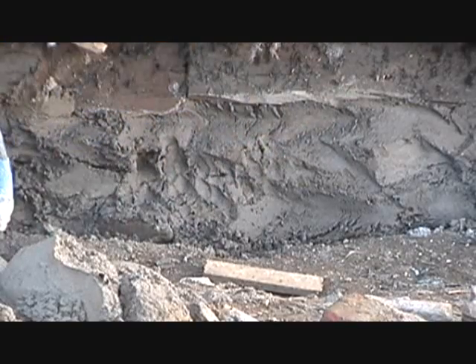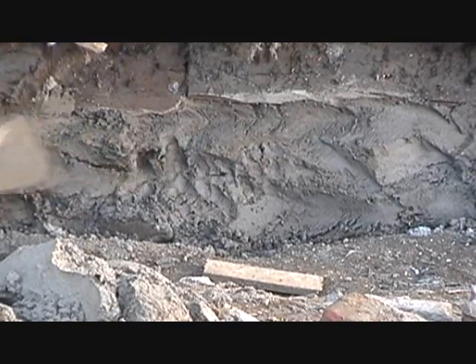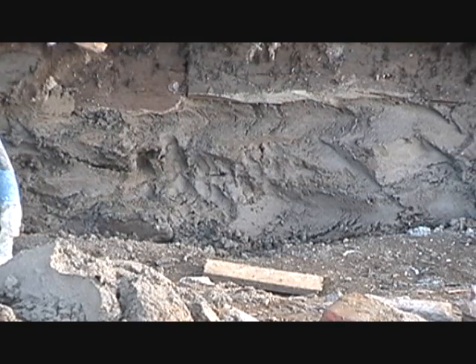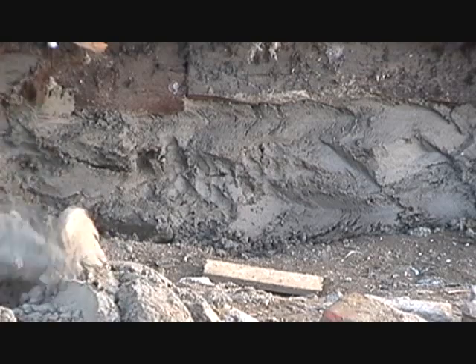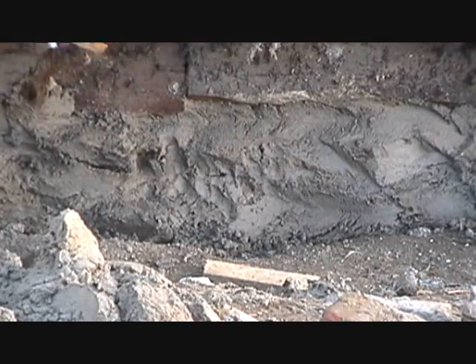We're back here on the second day. This is hard - see? It's not 100% hard, but it's hard enough. You really don't have to wet it the second day, but I always like to just do a little wetting down. Same thing: if you ever want cement to stick, wet it like this, and then it sticks. A little secret.